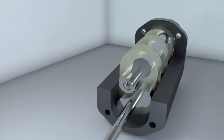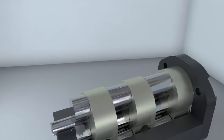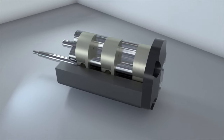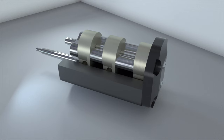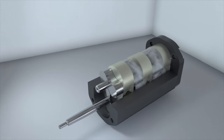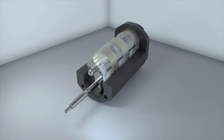They can pump not only liquids, but also air, and therefore create a vacuum. Multi-stage roots vacuum pumps can be used to provide the desired degree of vacuum. In this case, several pumping units are installed on the shaft. First, the air is supplied to wide rotors, where its volume is maximal, and then to smaller ones. Since the air is already compressed, it takes up a smaller volume, and more force is needed for its further compression. Rotating rotors pump the air out of the system, and removing the air from the system allows you to create a vacuum in it.